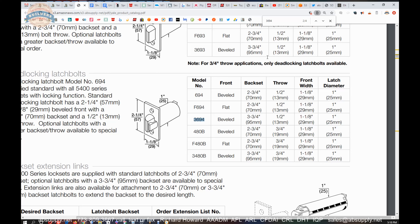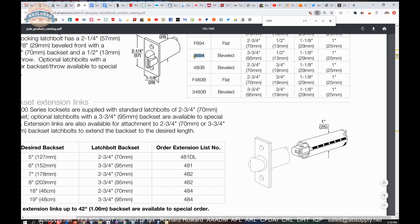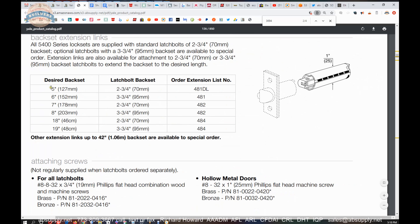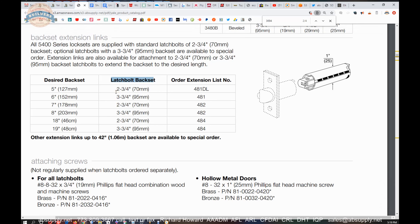So what's important: beveled, half inch latch throw. You'll find other latches here in the grade one listings — I don't see a 2⅜ inch backset. I recently supplied a 2⅜ latch bolt from a grade two lever for a client who had a discontinued grade one knob from Yale in bronze finish. The client was a widow whose husband had been a hardware sales rep, and she found an old Yale grade one knob lock in her basement — today it would list for several hundred dollars. We confirmed with Yale technical support that the grade two latch would work in that grade one lock, so she was able to resurrect that really awesome Yale knob lock, made likely in the 1970s.